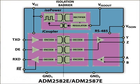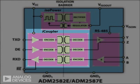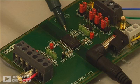I'm here today to introduce the ADM2582E and ADM2587E signal and power isolated RS485 transceiver. These are innovative new parts that integrate an RS485 transceiver, signal isolation, and power isolation into a small 10mm by 13mm surface mount package — the first RS485 part in the industry with both signal and power isolated in such a small package. This isolation is achieved using Analog Devices' iCoupler and isoPower technology.